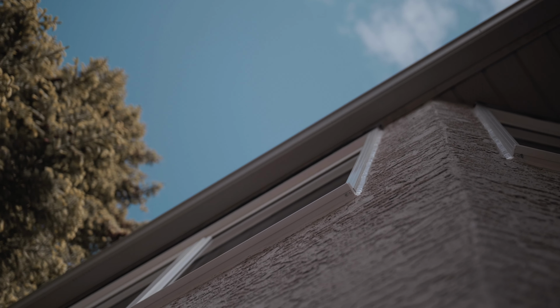So we're just finishing up our window inspection here of the replacement windows performed by Ecoline today. Everything looks good. We've had a look at the older windows and the reasons we were replacing them. We looked at the flashing that was installed. We make sure that the sill is in good shape. There's no water damage or any sort of deterioration to the existing frames.